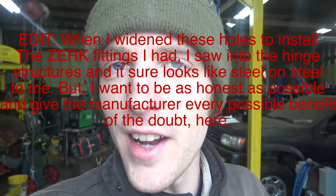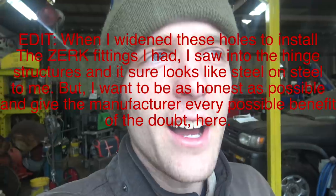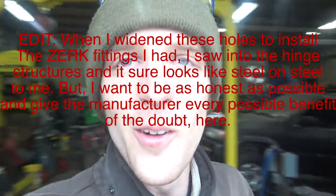So today that's what we're going to be doing. Could there be some bronze sleeves in there? Yes, I'm not saying there isn't - it's kind of close quarters and it's hard to tell. I honestly think it's just steel on steel rubbing dry in there this whole time. But either way this gives me an opportunity to talk about something I've wanted to talk about for a while - sometimes people ask me what I've learned buying all this farm equipment. After two brand new tractors and about 13 tractors total, plus several balers, a bunch of mowers, just all sorts of stuff, the main lesson I've learned is that you really can't assume anything. This brings us back to the trailer - I just assumed it would be fine, and now there's a good chance it's just been steel on steel for more than half a year. If I had followed my own advice and assumed nothing, I would have fixed this last summer and there'd be a lot less wear on my once brand new trailer.